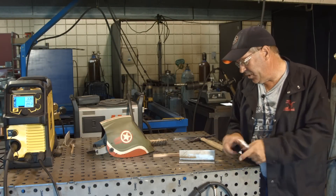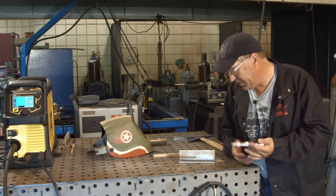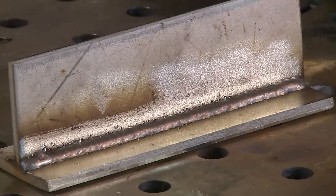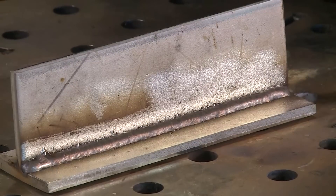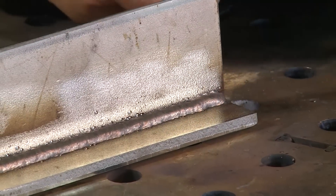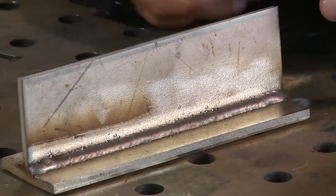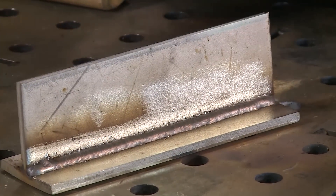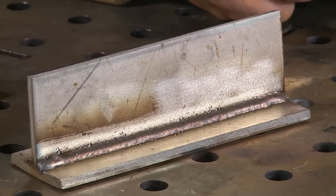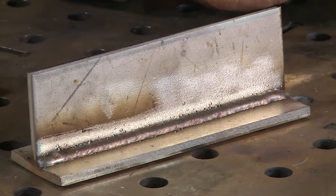I buffed this off with the high-speed wire wheel bead brush on the grinder. I didn't lay into it a lot or spend much time with it. You'll notice there's some spatter along the toe of the weld, more on the bottom than the top — not sure why. There's a little bit of a rounded profile and definitely a gray color. Is it a bad weld? No. Structurally it would be okay — it's just a simple fillet weld. The whole point was: if you're doing carbon steel work and somebody needs a quick stainless fix, you have stainless wire but only C25 gas — you can do it, it's just going to look a little funny.